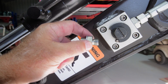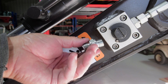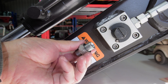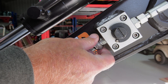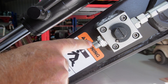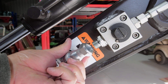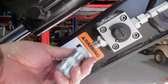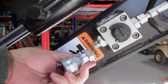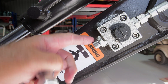I've got this out — I'm not going to throw this away because I'm going to use it in a minute. What we're going to do is replace it with another coupler that actually has the three-eighth BSPP connections on both sides, so you'll see that it's got a rubber seal on that side and a rubber seal on that side. So this just goes into the valve body, screws in the same way, and now on this side we have a three-eighth BSPP instead of our metric light connection. That connection will actually fit this coupler here, and this coupler is made to a standard called ISO 7241A, which means that a lot of different manufacturers around the world actually use it.